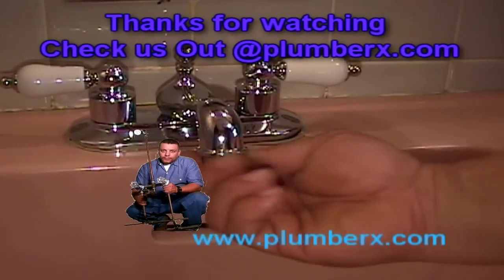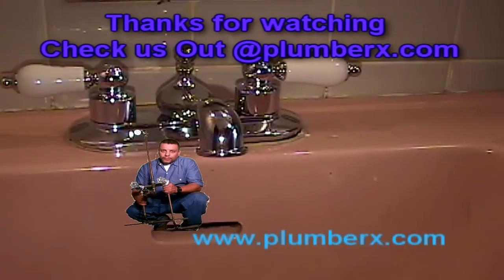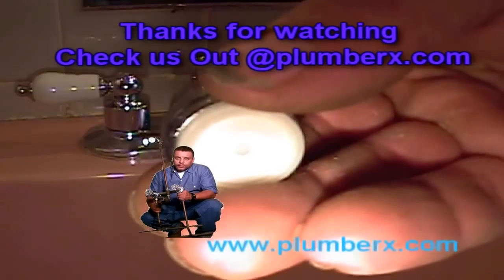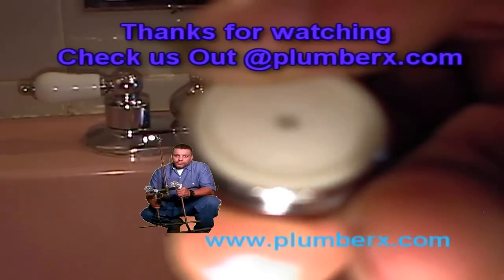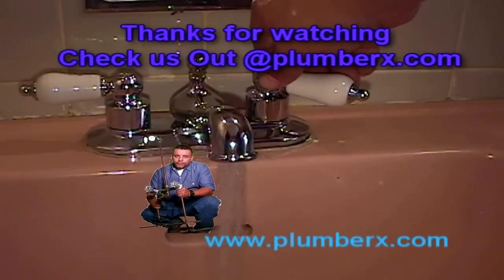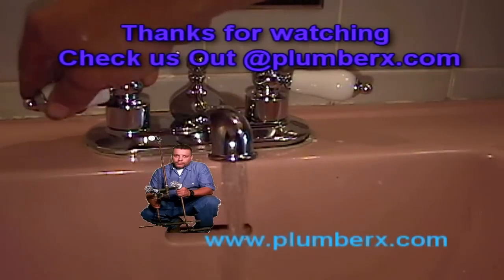And here we're going to pull the aerator off before we turn the water on so that if there's any objects or anything in the water, it won't get stuck in the aerator. And you can also do this on your older faucet if you have low water pressure, and just pull it off and clean it out.